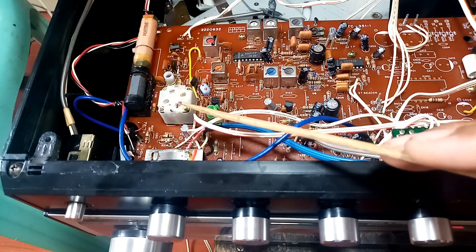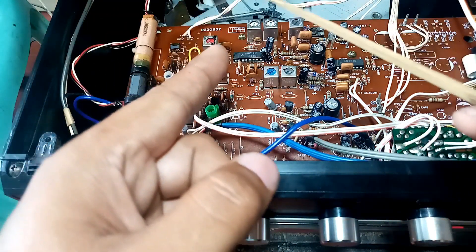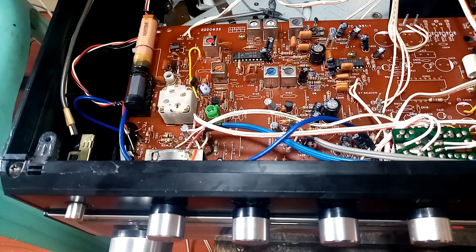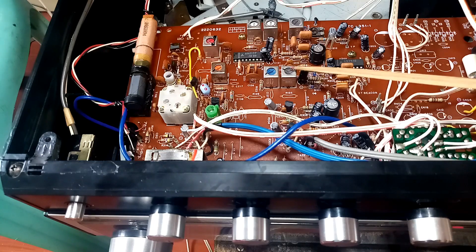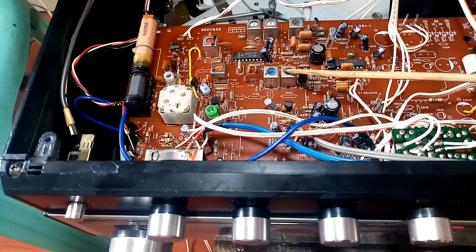After turning both oscillators I moved the 88 frequency down to 78 and expanded the upper end to 105.1 megahertz. To fine-tune, I turn the IF transformer core: first clockwise one full turn, then counter-clockwise, listening for the best reception. I have my own markings — where the reception is best, that's where you stop. Turn two clicks one way, then two back, going further if the reception keeps improving.